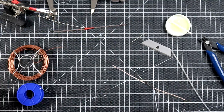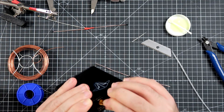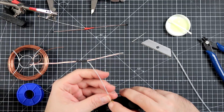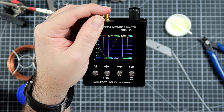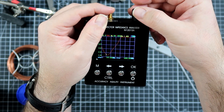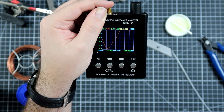I have my trusty VSWR meter. Let me put together my super awesome converter and measure the VSWR of this antenna. It won't be perfect — it will be probably slightly shifted — but nevertheless, working. Center tuned at more or less 861 MHz, down to 840 MHz VSWR is still below 1.5 — very nice. And on the higher side of the band, up to 877 MHz, still around 1.5 VSWR.